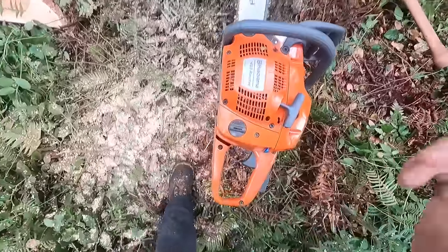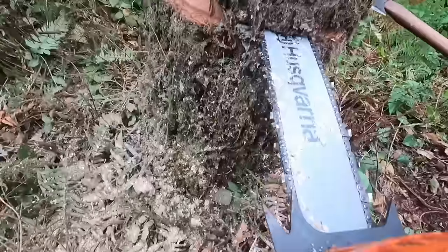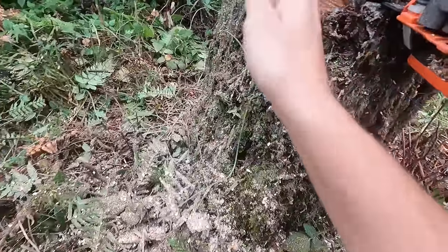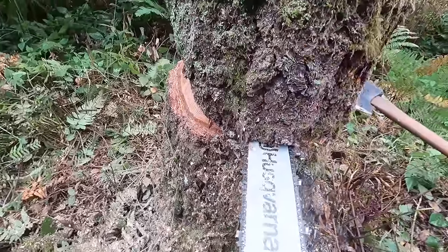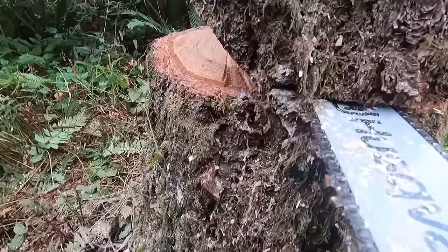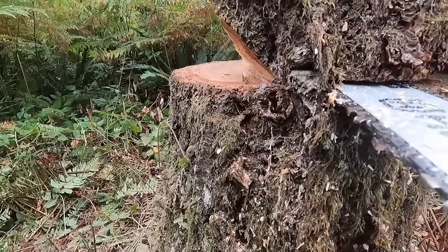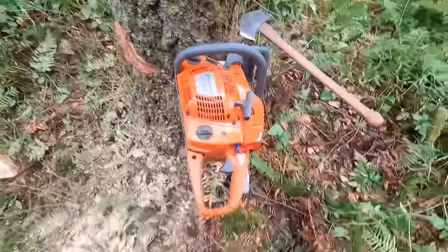And by pulling the bar out like this, when you're dogged in, remember the bar's at an angle like this. So you think that your bar is running this way, but when you pull it out, you'll see the bar is actually running that way. So pull it out a little bit. That'll help tell you where the holding wood is on the inside. I got a little more wood over here, but cut a little more over there.